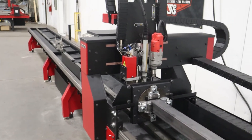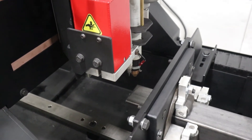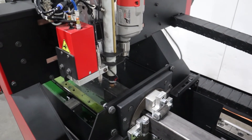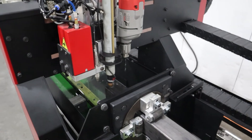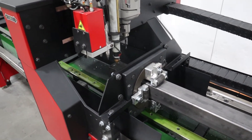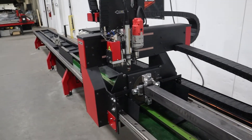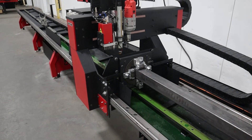Now I'll hit Page Up to raise the torch out of the way and load up the program. A couple of points before I hit Run: the drill routine isn't fully optimized yet — we're feeding down at two inches a minute and I'm starting a little high and going a little low. Also, I'm not putting coolant on the drill. We're contemplating that as an option — the green liquid here has no lubricity, but I don't want to spray WD-40 until I confirm with the manufacturer whether we can add oil without making it toxic.